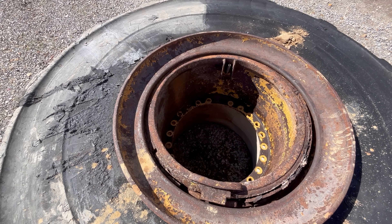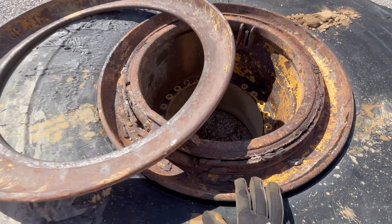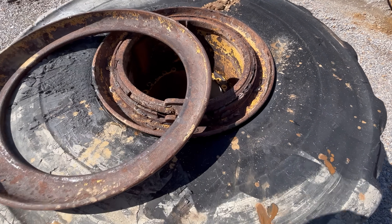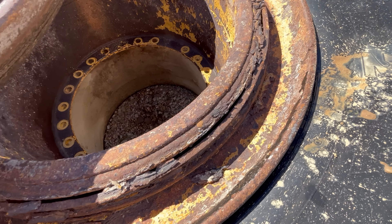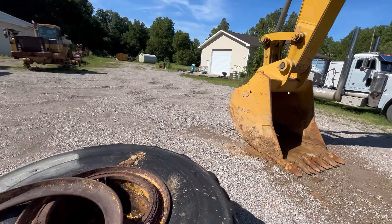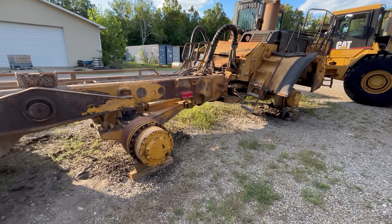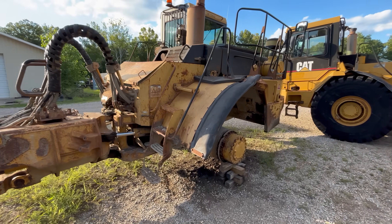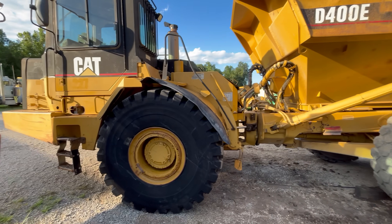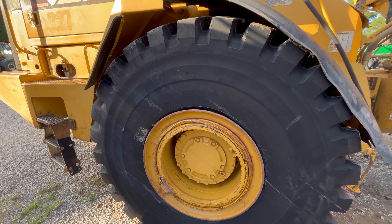What I've been doing is taking one of these rings from another wheel — you can set it on top of here, on top of this part of the five-piece wheel, then you can push down on that ring and it'll push that apart. Normally they'll come right apart with just a little tap, but not when they're stuck together like this. I had the whole front end of this excavator off the ground pushing on that and it finally broke loose. I'm putting the four new tires that came off it on this here dirt hauling rig — four brand new Bridgestone Radial 29.5 R25s. What a deal.